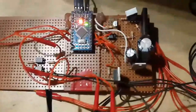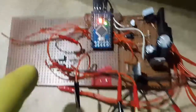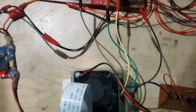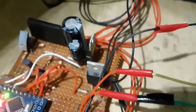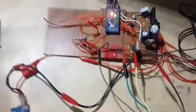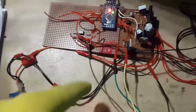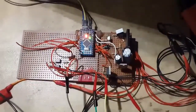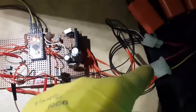So if there is no power and the battery voltage goes below a level set in the sketch running on the Arduino Pro Mini, Arduino's GPIO pin turns on the optical isolator. On the other side, the Raspberry Pi GPIO reads a low and it shuts down. After that, Arduino starts the timer, and when the timer is up it turns off the N-channel MOSFET, cutting power to the buck converter, because the buck converter's negative wire is connected to the drain pin of the N-channel MOSFET, whose source pin is connected to the common ground where the power supply negative and battery negative connect to each other.